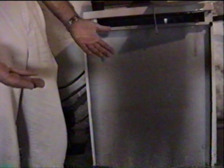Okay. Sort of like a French drain, except it just. Well, let me see how this one's set up. It looks like this one here. All they did was, when they poured this basement, they drained the hole in here. So this was put in here to take water that got in the basement into it. Right. Most sump pits traditionally are designed to take water as it rises, because the ground gets wet. As it rises from below us, it doesn't come onto the floor; it would be pumped out prior to that. So that's what most of them would be.